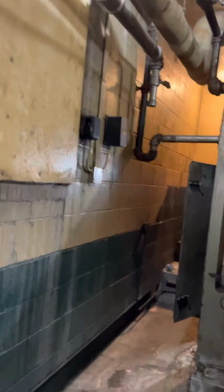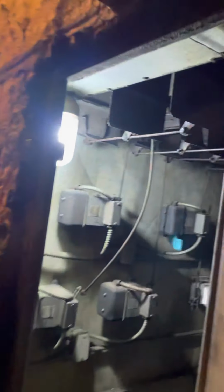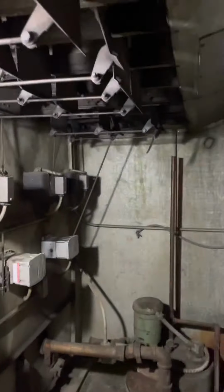There's a hot water coil in this air handler now. So they're utilizing a boiler now for heat, but they want to do a conventional system of some kind where they can have each zone have its own system. Right now there's 8 zone dampers on this air handler. The zones go through the floor. This is the bank here of dampers. Goes over to the wall.